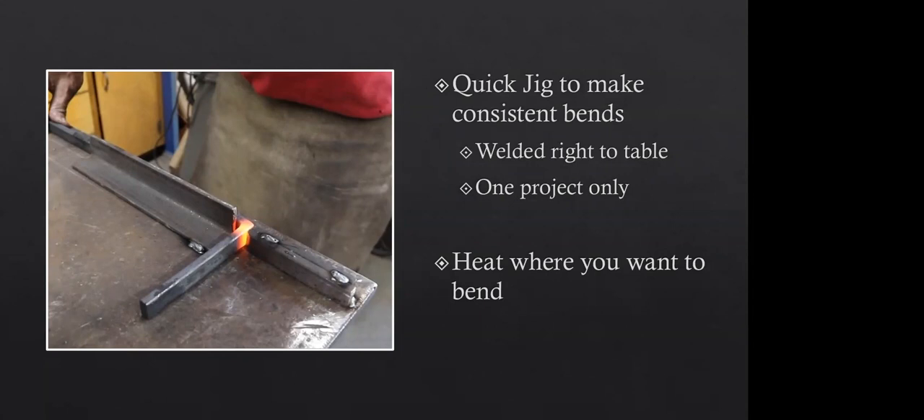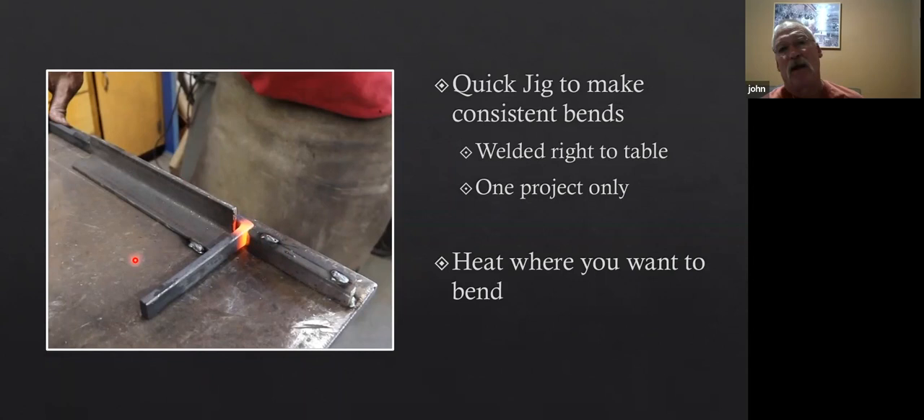This is a quick little jig to make that real tight radius bend close to the square corner. The side at the corner where two flat bars are welded together — the face of the flat bar nearest me is on the same line as the face of the square corner nearest me, so that keeps everything in a straight line on that plane. The angle iron is welded there to hold everything in place, and I can just push that corner up to the flat bar, clamp it in place, and then make the bend.